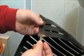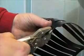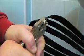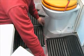The kit comes supplied with these natty little clips which perforate the plastic and make contact with the copper braid inside the sheet. Squeeze the sides as tightly as you can together using pliers or mole grips. Once each strip has its connectors fitted, you're ready for the cabling.